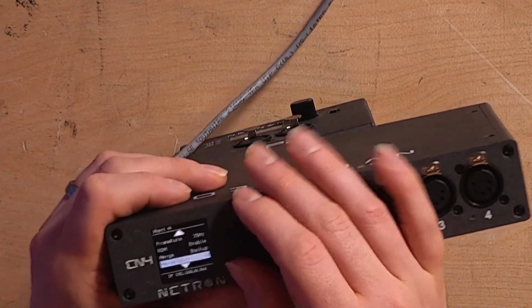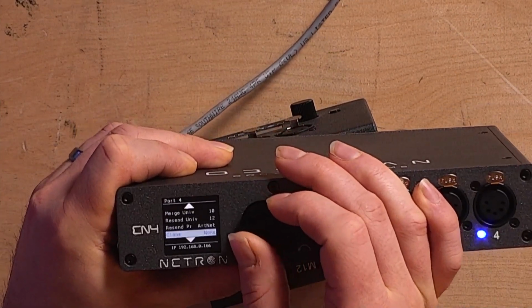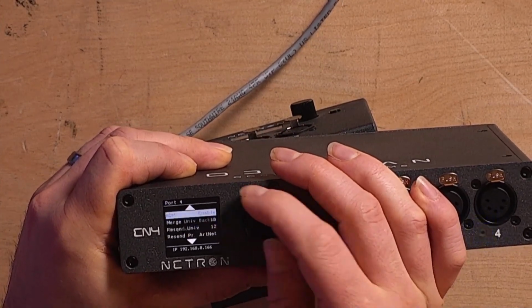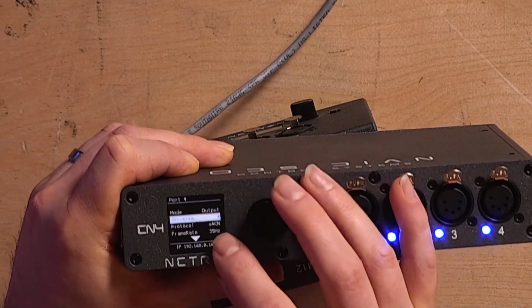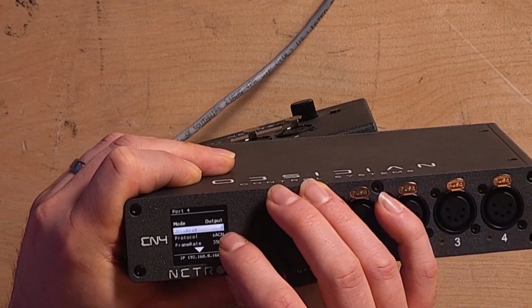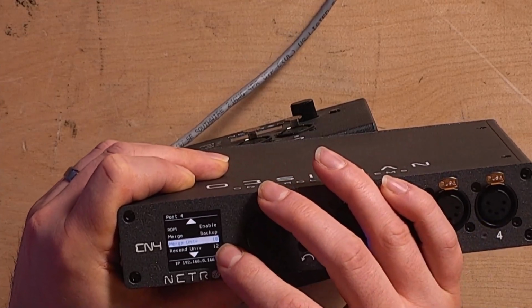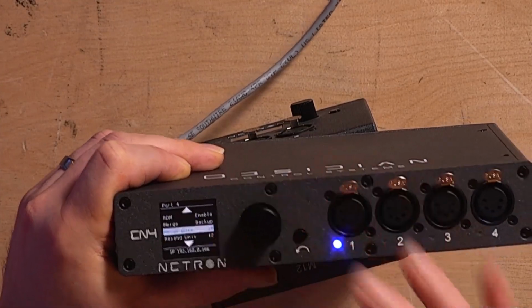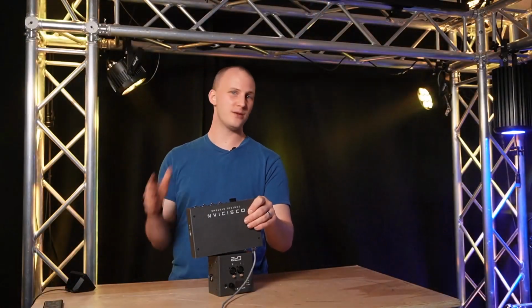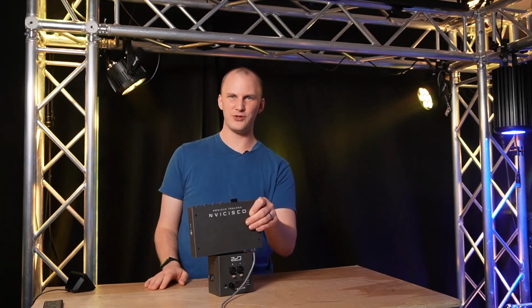So basically within your ArtNet or sACN universes, you set up a merge universe and the universe of the port. So this port is outputting universe 4. That's going to be your primary console. Okay. Universe 10 is your backup universe. Okay. So if you have a guest LD, you have somebody else coming in, you tell them, send universe 10. You have a house light system, put that on universe 10.